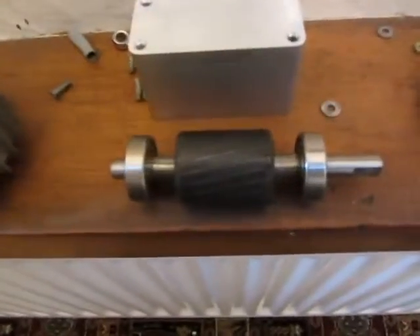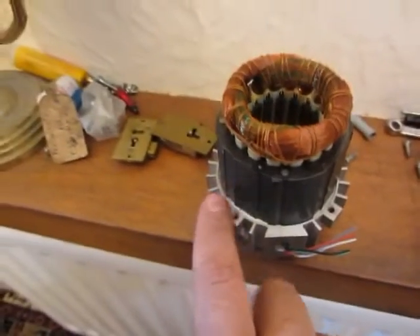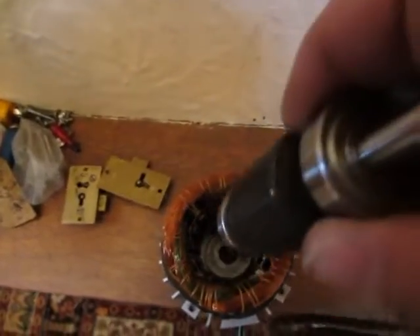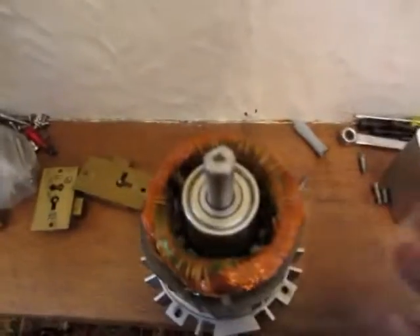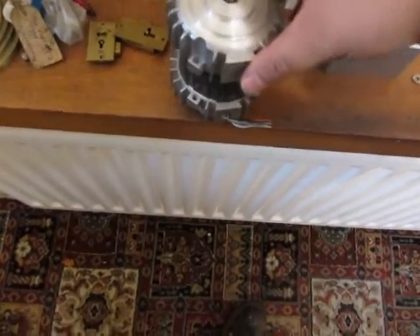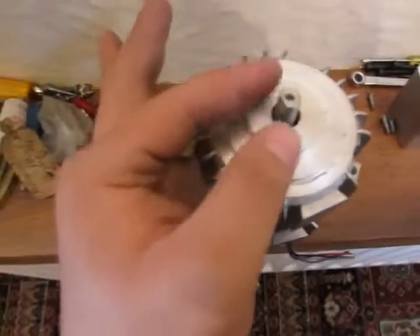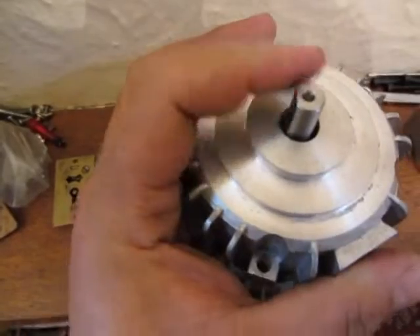This is the very last part of my video. There's the motor shaft which I've just pressed. I brought in the motor stator and motor end shields which we've cast in the last videos — that's two of them, with the wires coming through. The motor shaft drops down into here and you can see it spins freely inside the stator. A closer look at the top motor shield, which also has a recess for the bearing. It fits over and the whole thing is screwed together with 70 millimeter M4 Allen screws, and the motor spins round to drive whatever it's going to be driving.